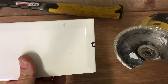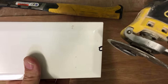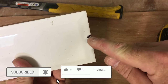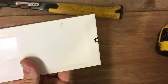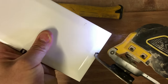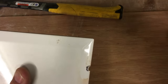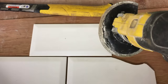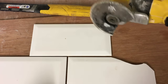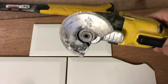Another situation: you can put on the carbide blade. This is the blade I normally use for taking grout out between tiles, but you can actually use it for cutting or shaping tiles as well. You could be tiling up against a socket outlet and need to notch out a little bit for an electrical screw to go through — rather than going to your tile saw, you could simply use the multi-tool and just nick that out. But aside from that, the main purpose of this blade is raking grout out. If the grout is discoloured, black, or mouldy and you need to dig it out to re-grout, this is where the tool is invaluable — just run along the grout lines, take it out, then re-grout the tiles.